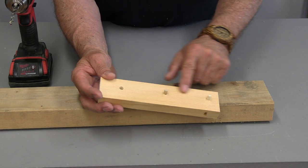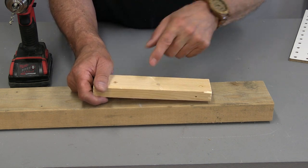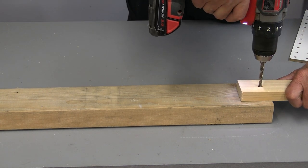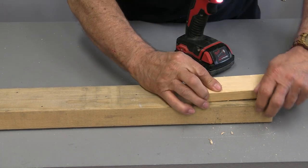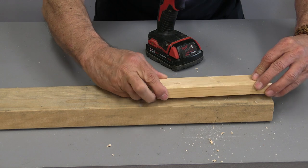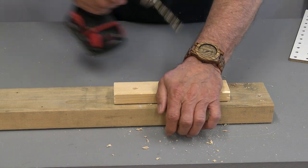What I've made up here is a little hole-drilling jig. I used a pegboard and I didn't want to drill holes every inch — in this case I wanted to drill them about three inches apart — so I've got two dowels to set my spacing and a third hole as the drill guide. You make the first hole, put the first dowel in, find the second, drill the next hole, then move the jig and it gives you an exact spacing. You just keep moving along all the way down.